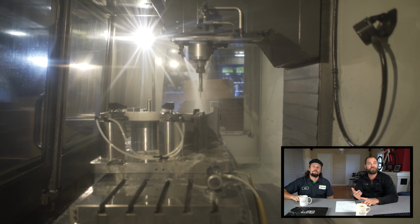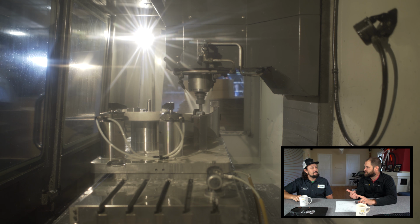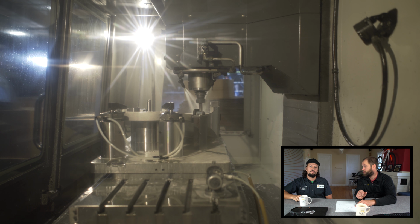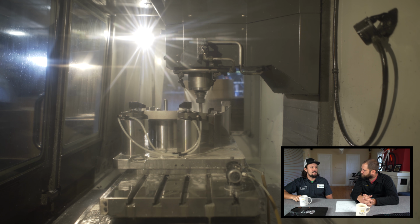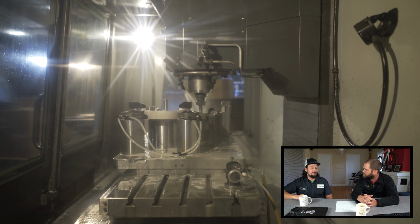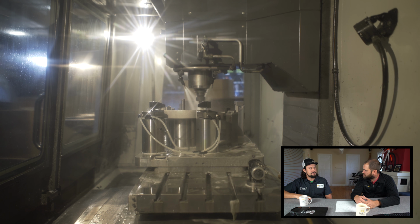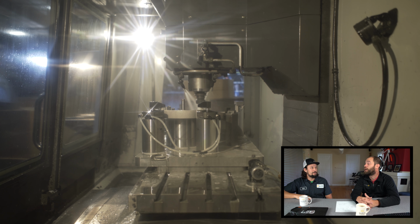So you said they're shot blast, which, correct me if I'm wrong, is a process that happens before the machining. So right before they go into this machine, there's the shot blast machine right next to it. Yeah, we have this big old-school giant shot blaster that we shoot a bunch of tiny stainless steel BB shot at it. It cleans it up and knocks 99% of the flash off. It adds a little bit of texture to it. Yep, it helps make the paint adhere a little better as well.